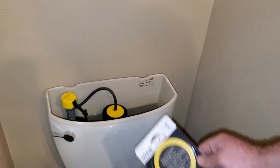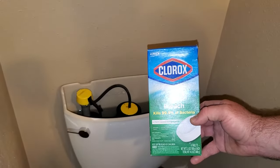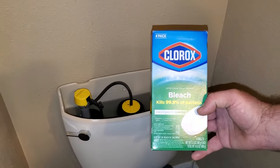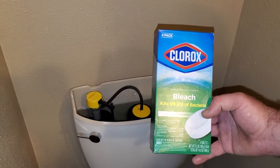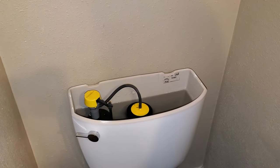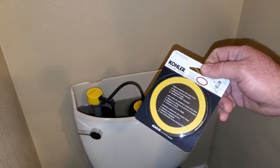The reason we've had to replace this seal even though this toilet isn't that old is we always like to use these bleach tabs in the toilet. They go in the tank and they help keep it cleaner and sanitary. They can also help extend the time between cleanings and prevent any mold growth. But the downside is they also eat up the guts in the back of the toilet, which is why we have to replace this seal more often than regular. Not a big deal — this thing's about six dollars to replace and it's a real simple replacement.